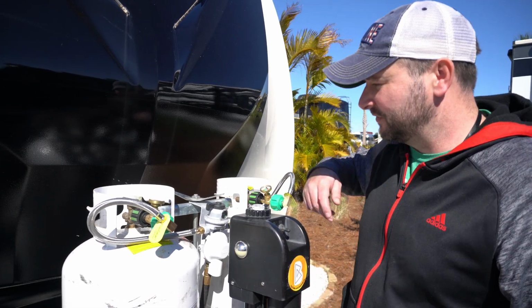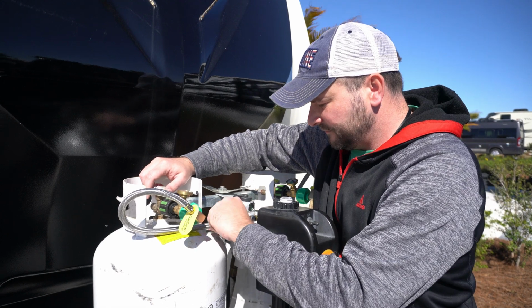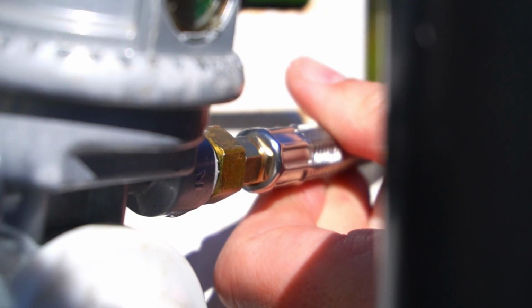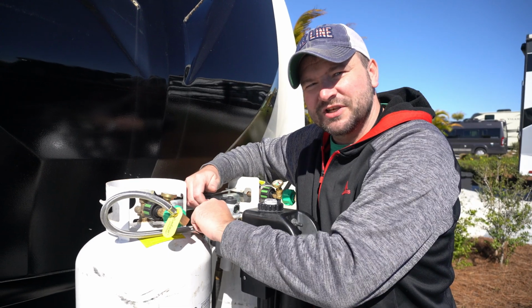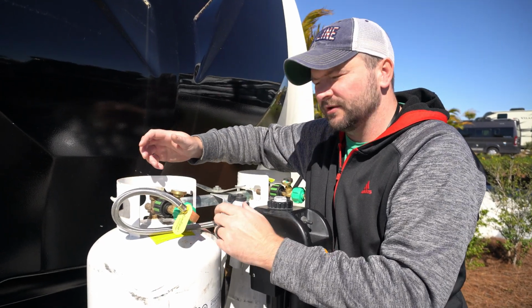So now all you have to do, once you've got the GasStop installed and these pipes in, and don't forget, if you find that these don't screw on too much, you can put some PTFE tape, that's what we call it, I can't remember, plumber's tape, around the seal. It just helps it seal in there. Mine were fine, they were working okay, but you can always do that.